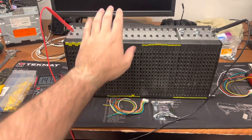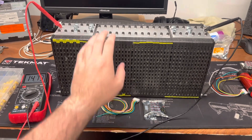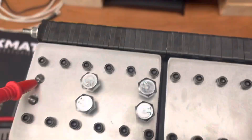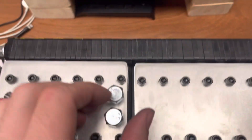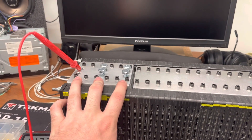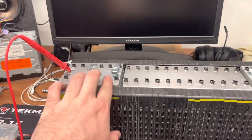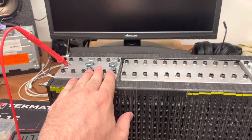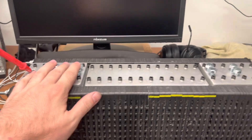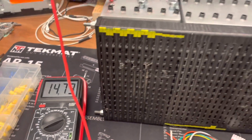We're back with video two on the SPIM 08 HP cells. We have the bank assembled. First problem - I need to cut these bolts down so they clear each other. This spacing is just wide enough that we can fit copper lugs here, and it clears here. Just angle it a little bit, not even bending them that much, just a few degrees. And it'll clear. So that's why these are spaced like that. Resting at 14.7, which is about where I charge these to.